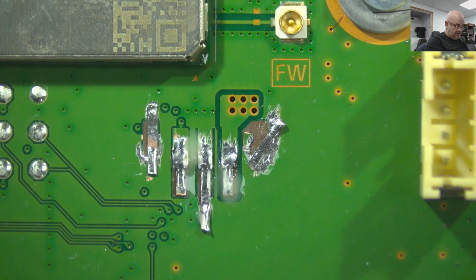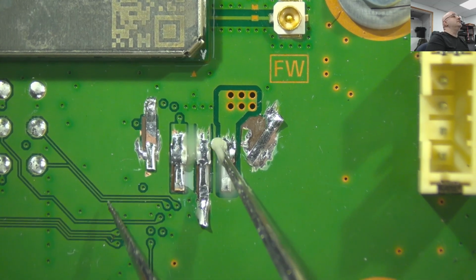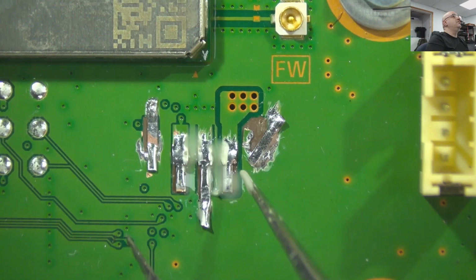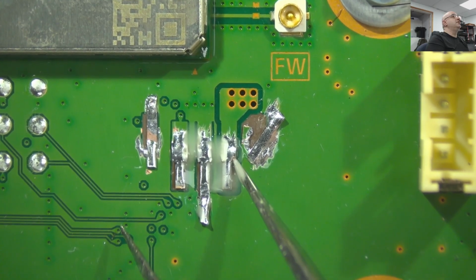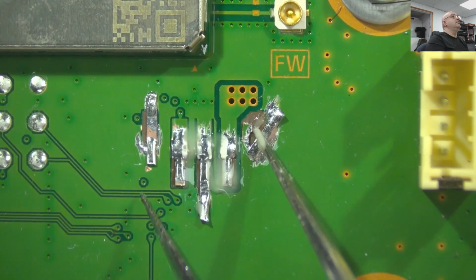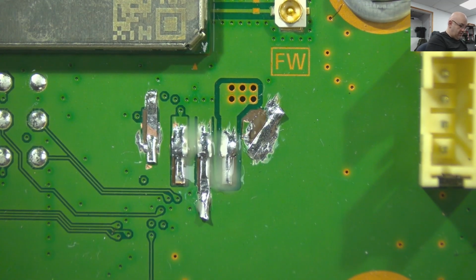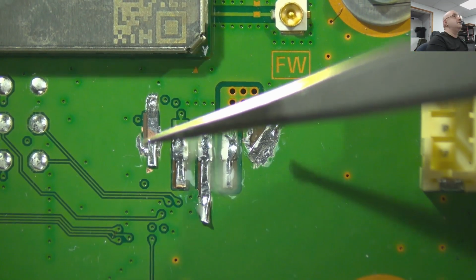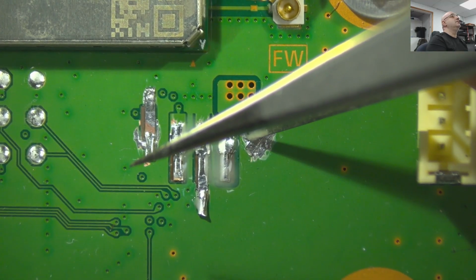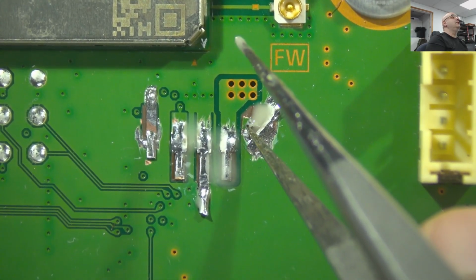Trying to get some underneath them pads that we lifted, because the whole connector is gonna stay slightly up. Yeah, we're gonna clean the top of this in a second. Just try to get as much as we can underneath. Some in here. Even though I don't think we need any underneath there. Once the ground leg's gonna go on here, everything's gonna be soldered together, hopefully.